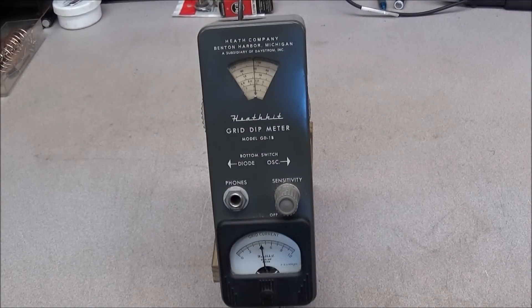So we know that's a good start, and next we want to know what the inside looks like. There are two small transformers and capacitors inside. Being this meter was made between 1954 and 1960, it's about a year older than I am, so it's got the original capacitors in it — they would definitely need to be replaced.